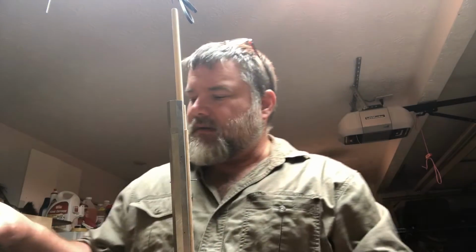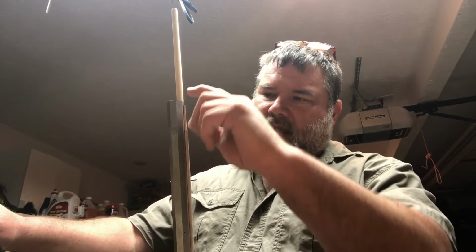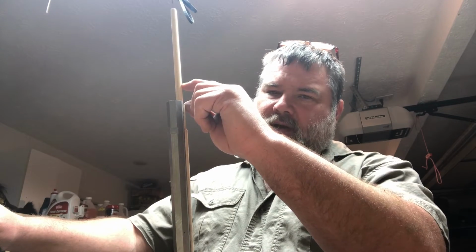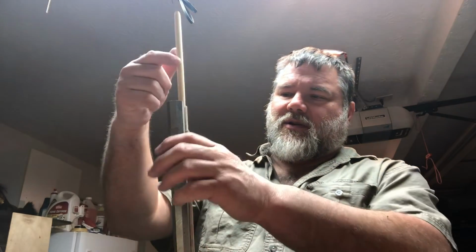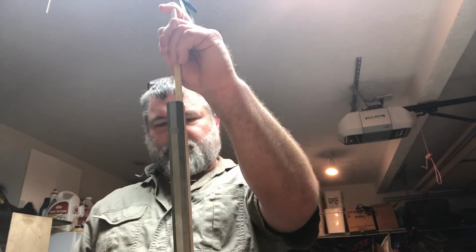You then cut it off right at the barrel. Some traditionalists have the ramrod stick out a little bit further than the rifle, so it's easier to grab hold of. That's the way my dad's rifle is, a very traditionally built, Hershel House built rifle. That's fine and dandy, but man, I got a bunch of dust in my beard. But in the modern day, that runs into problems when you're trying to put it in a truck, because there's no way to really lay it down and not put pressure on the ramrod. So that's a problem. With that said, I'm going to cut it off right at the barrel and take it from there.